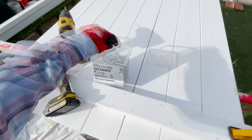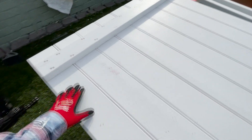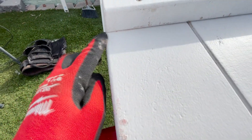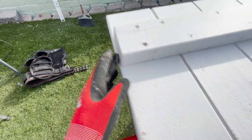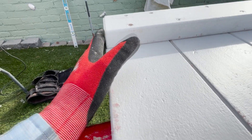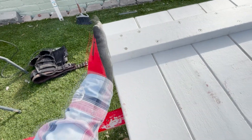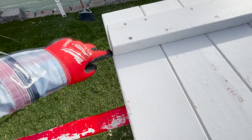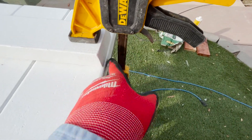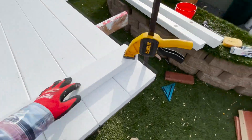We're using stainless steel three-inch screws for the two-by-four. I have it set back just about an eighth of an inch from the end of the radius of the two-by-six, and the angle is about seven to ten degrees. That angle keeps this from hitting the post as you're closing it — gives it a little clearance. Same reveal on this side, set back about an eighth of an inch, so it's guaranteed not to hit the post and it looks nice. On the other side you can just go flush.